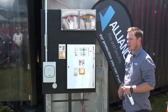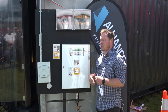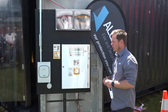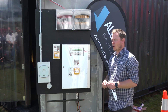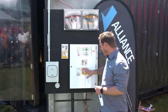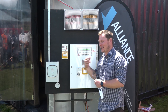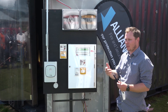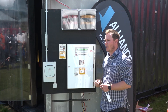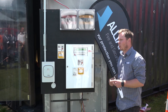Tronik has representatives here from the manufacturer. They produce a pretty easy-to-install panel. The idea is we use a smoke pen to activate stage one — very similar to what a gas flood looks like. You can actually inhibit the DSPA to stop stage two from firing. For example, if one of two people gets knocked out and you need time to act, you can inhibit it. We've built in a 30-second delay as standard. Today we've put it on a 10-second delay — that's still a long time. In bigger rooms you could go up to 60 seconds, depending on the risk profile.